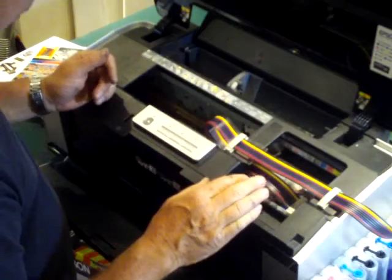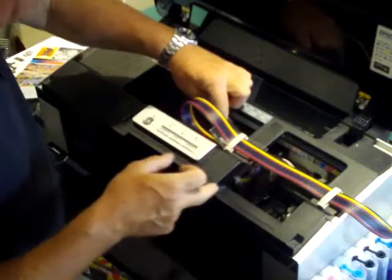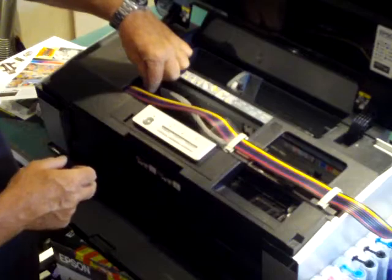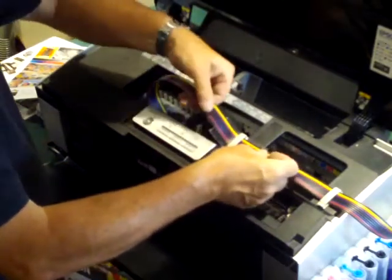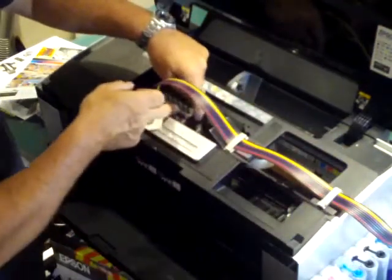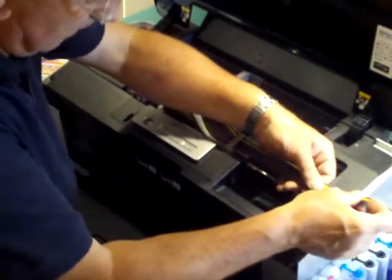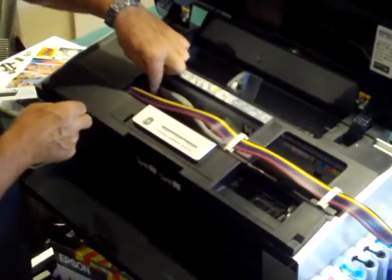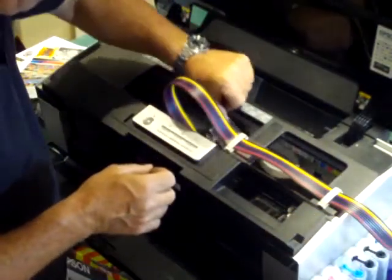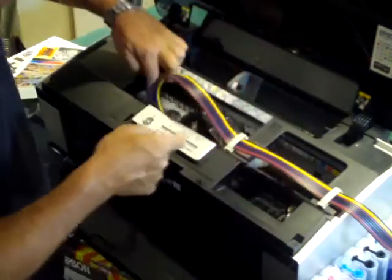Now the last thing we want to check before turning on is making sure that the carriage can go all the way to the left. In this case it's about spot-on, but let's move it back a bit. See how this tubing — we can actually slide the tubing up. If your tubing is a bit tight, you simply ease that up a little bit until it's reasonably tight, and then we want it nice and parallel. That's about the right arrangement so it can move to the right and all the way to the left without causing problems.